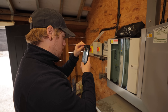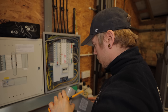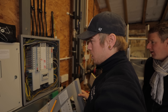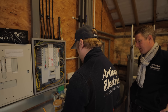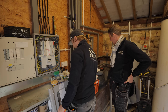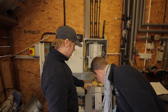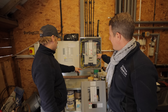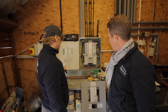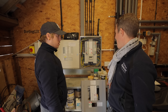The labelling was completely incorrect here and Lee was left slightly befuddled. It says 'DB right hand side' but on the board it says 'DB left hand side'. It also looks like it says DB7 is fed from the sub mains. That's wrong — they've labelled this as DB6, but in the sub mains DB6 is on a single phase. So this must be DB7, and DB6 must be that single phase in the barn. What a mess.